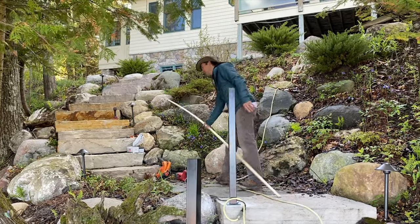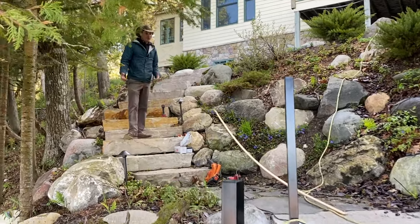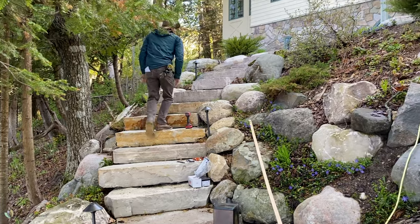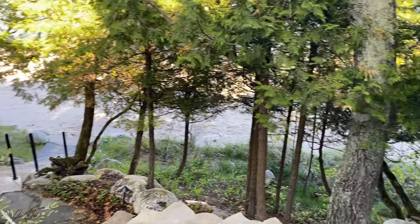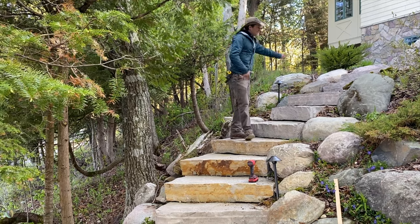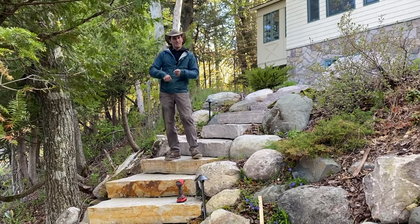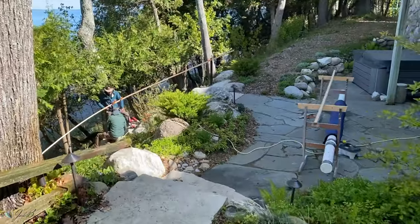This next section here is going to be a lot longer. It's the biggest curve we've ever done. We actually have to scarf two pieces together that will be all steamed up and noodly to do this whole entire section as one big curve, one big steam. So there's gonna be five or six posts up this outside edge here that will be getting the posts set while the steamer is heating up the wood, getting them all noodly. They're gonna have to cook for at least an hour in the steamer.